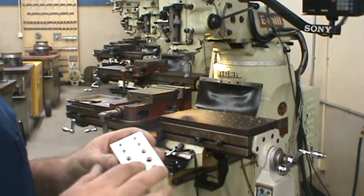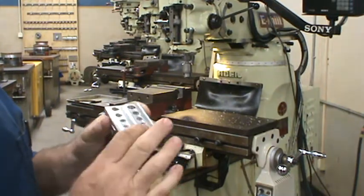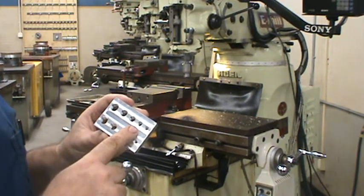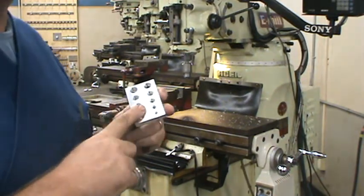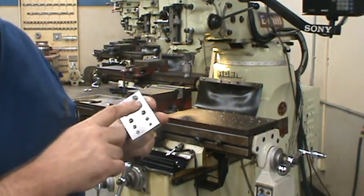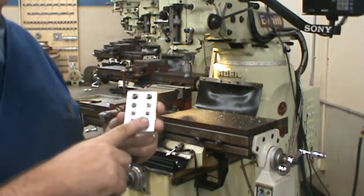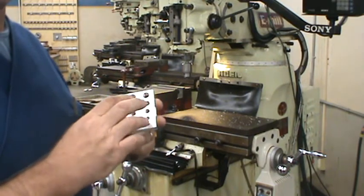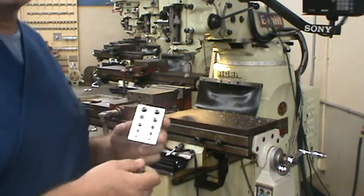If all your countersinks were correct on the first operation, you would have faced the material to a thickness of 375 all the way around, and you'd still have burrs on this side. If your countersinks were too deep on that first operation, you may have faced this material and probably also have burrs on this side as well. So you'll need to countersink not only on the far side, but on the near side again — to redo some that were done to the correct depth but now have no countersink after facing.